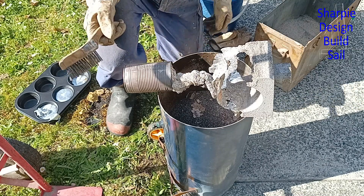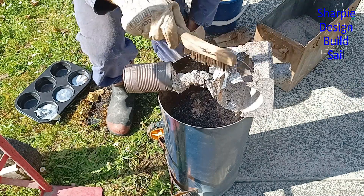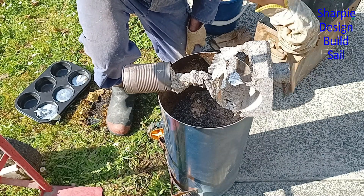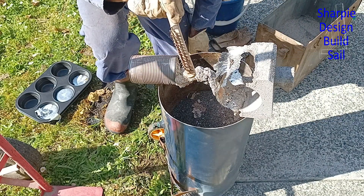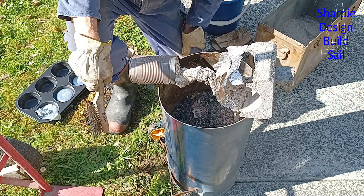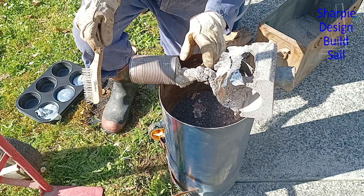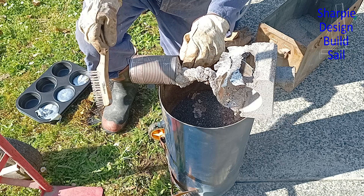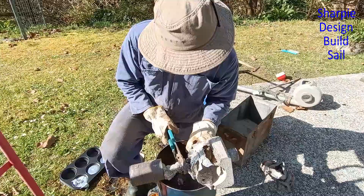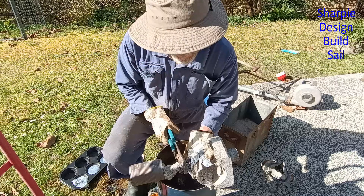I might have to bite the bullet and buy a temperature gun, like an infrared temperature gun, and make sure the temperature's right before I pour it. It's got to be 720 degrees, I think. My sprue might not have been big enough. The can might not have been big enough. There's one or two people who follow my channel who know a lot more about casting than I do, so I'm hoping for their advice. It froze up, I think. Temperature possibly wasn't hot enough. I think the sand collapsed right down to this surface here, and that sand in there didn't really seem to collapse, which I was expecting to be a problem.